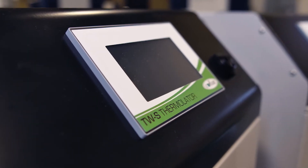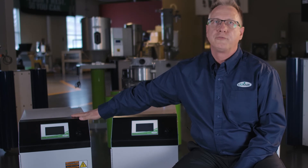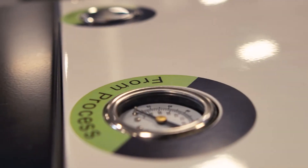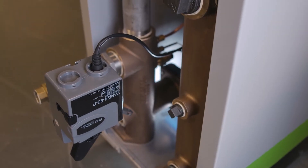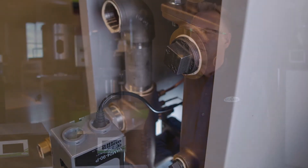The TWS unit comes in a small footprint when under five horsepower or under 24 kilowatts in capacity. It comes with analog gauges, and a digital readout on the control panel is an option. You can choose solid state relay heater control, a phase monitor to check incoming voltage phase, a full flow filter, and a full flow meter so the HMI can read flow going to your process. The screen saver is customizable — when it goes into sleep mode, you can display a simple set point temperature.